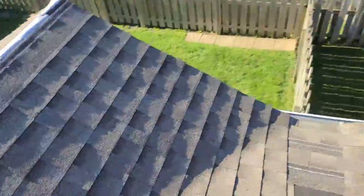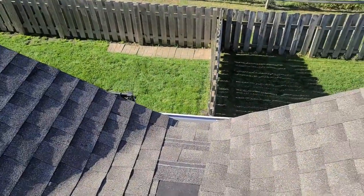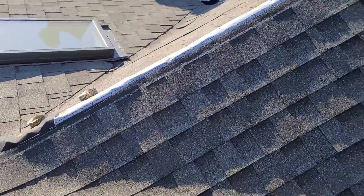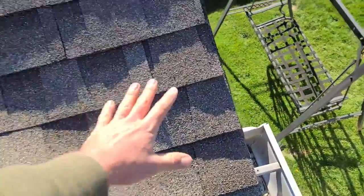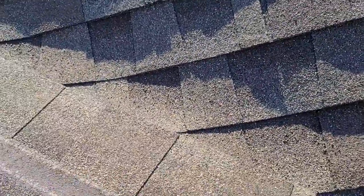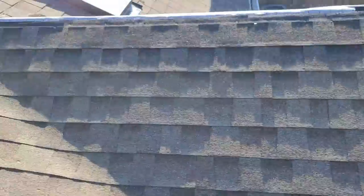I probably confused him. Really, he did a nice job on it. He did a great job, but I think it's done backwards. So I'm just going to go ahead and do it and decided to make a video. What he did was he put shingles down. Look, rake looks real nice, everything. He dropped these down nice and low. This had plenty of coverage so that we could have snapped our line and had our thing come down right here. Now, the problem is this is where valleys get tricky.